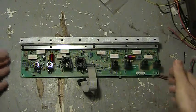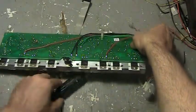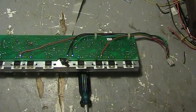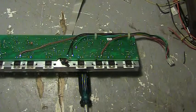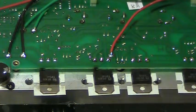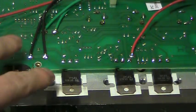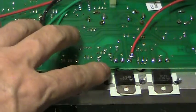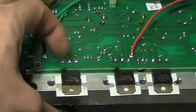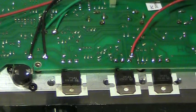On the other side of here we can see what actually has happened. There are eight output transistors — bipolar transistors — and the design is about 15 years old. Zooming in, we can see two scorch marks here on the PC board, on the edge where jets of gas spewed out from where the leads meet the plastic package of these transistors when the transistors expired.